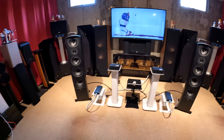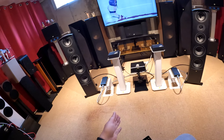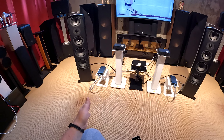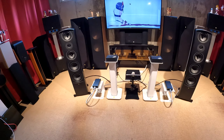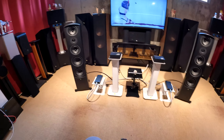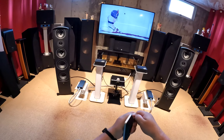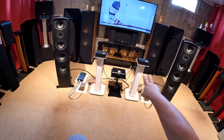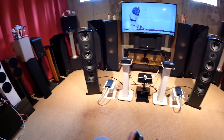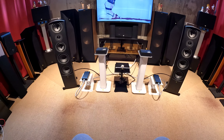Four ohms is automatically making some of you go 'oh no.' Ohms is the level of resistance — lower ohms means less resistance, which is actually harder to drive because more power has to cycle through the amplifier. It's the best way I can describe it — I'm not an electrical engineer. All I know is if you touch speaker wires together that's essentially zero ohms and things explode. The Starkrimson can do down to two ohms. Anyway, the bass response on these is phenomenal for a six-inch.